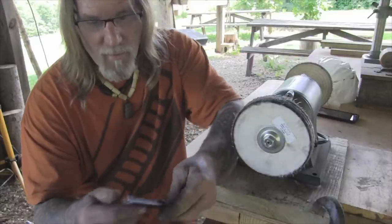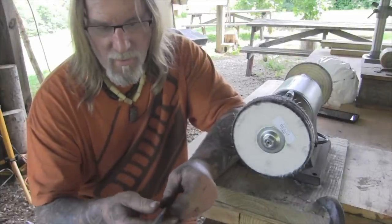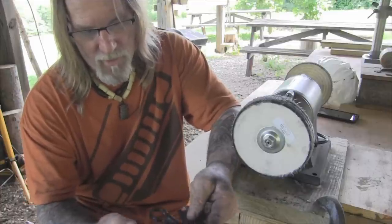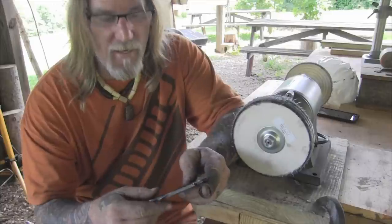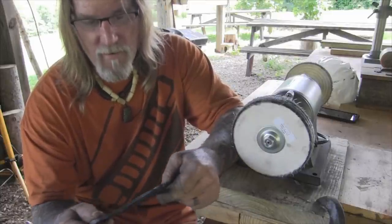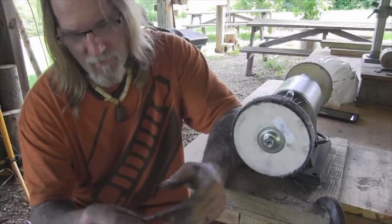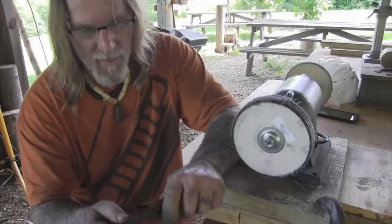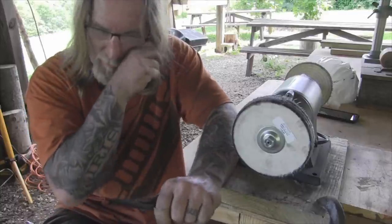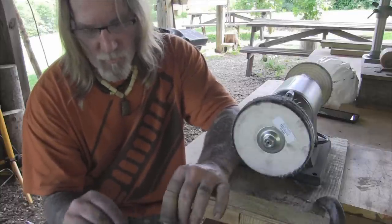It takes a little bit of tweaking and grind work and playing around to get exactly what you want with this thing. The way this is working right now is it's held by friction because this is offset and it becomes a spring — you'll hear it pop right there — and that pops it over into place so the blade locks right there. That locks your blade in place and now it's locked from coming backwards, and you have a handle that you can use and choke up on the knife there and do any fine carving that you want to do.